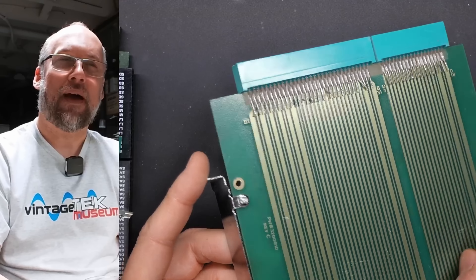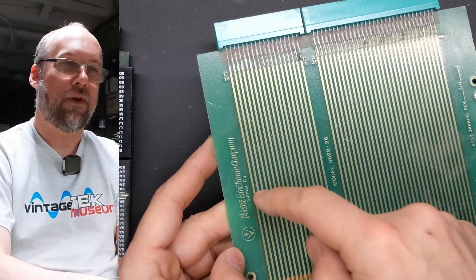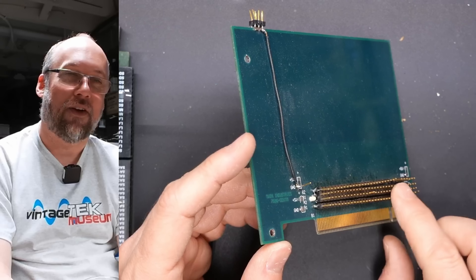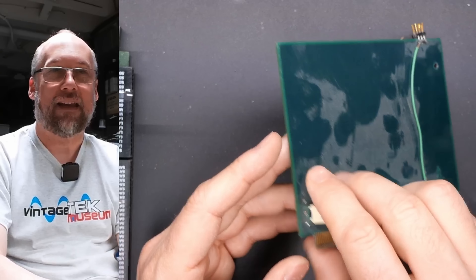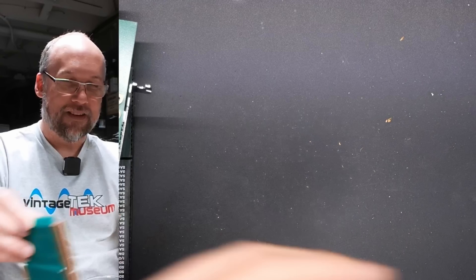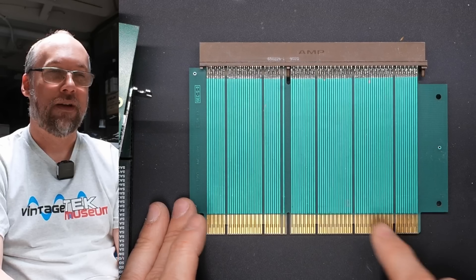This one has the slot cover on it as well, with some holes for ports. And look at this — hilarious, I guess you need to do what you've got to do and set some dip switches. Maybe your card under prototype plugged in here has some select logic messed up so you just bodge this in. And there's another one of these that seems unmolested on the front side. All these pins stick out — my assumption is that's on purpose so you can clip on test leads very easily. On the back same thing. These are obviously power leads here with thicker traces. Also from Vector.